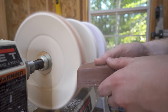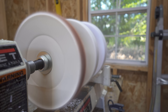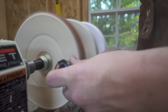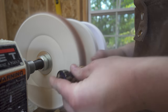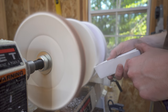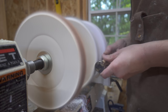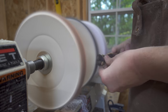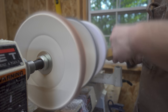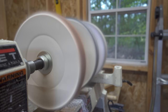It was time for buffing. This three-wheel system I have from my lathe works amazingly — it's the very first time I've used it and I'm super impressed. There will be a link in the description. It goes from a harder pad with a lower grit compound to a softer pad with a higher grit compound. The only trick is never let your project sit still against the pad, as it will burn off any finish. Keep your project moving, use plenty of compound on each wheel, and it will come out great.